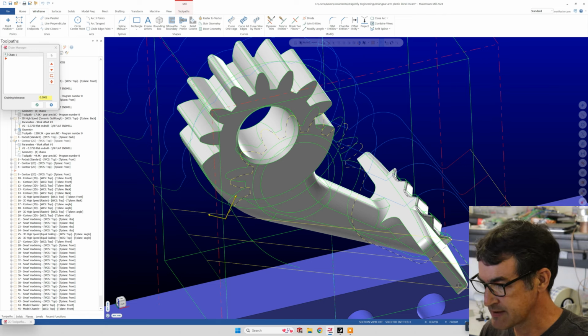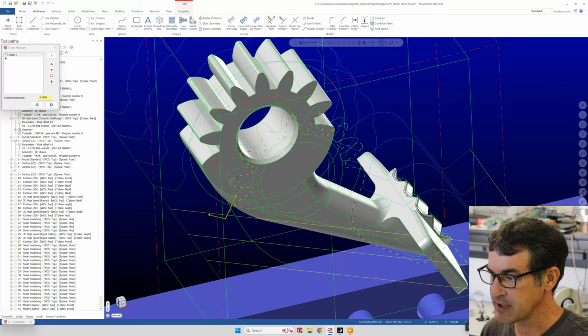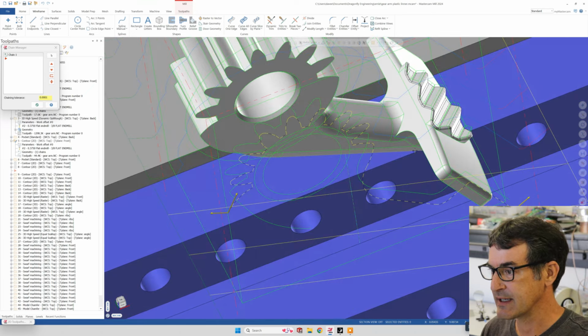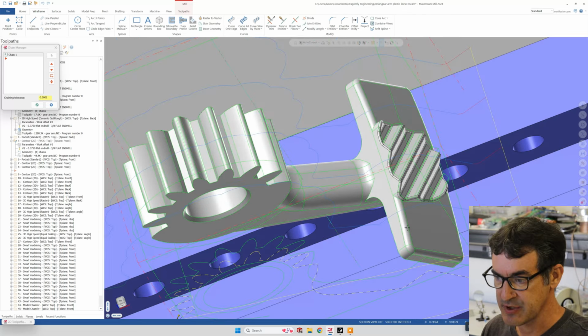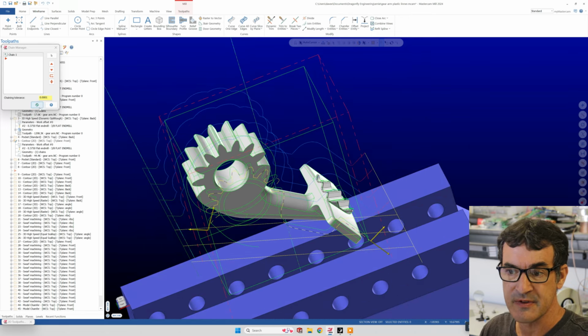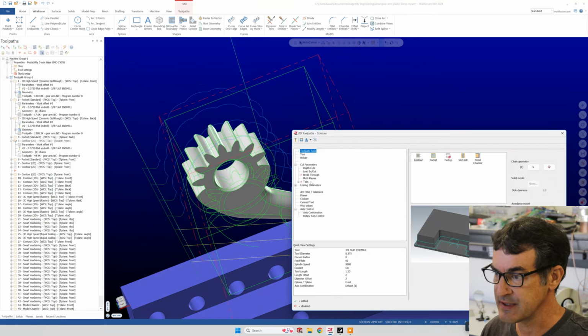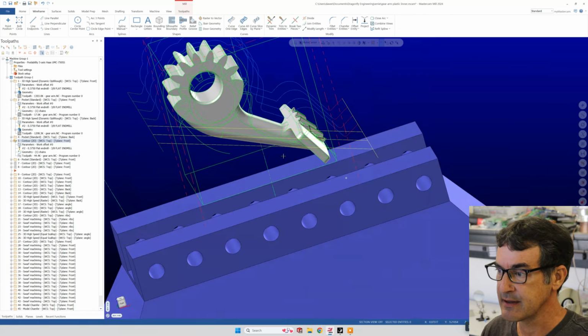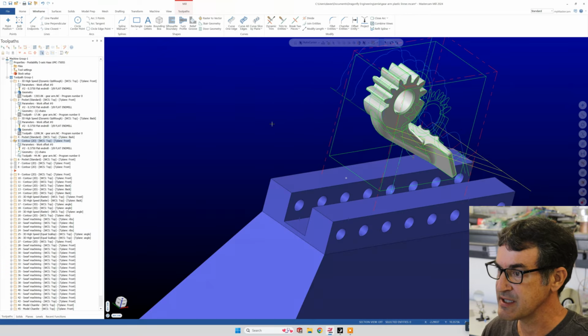So I probably picked this surface right here as my plane, and then I projected the sketch off of the 3D features. As you can see, we've got an arc here, and this is just a vertical line relative to the sketch line. So you can create these projected profiles, which is really handy for 3D machining. And then we use this sketch to do this toolpath operation. You can see the multi-step machining in blue off of our projected sketch, which is this one.